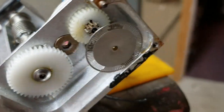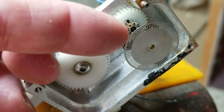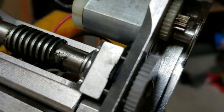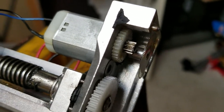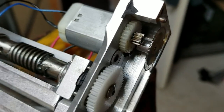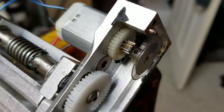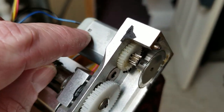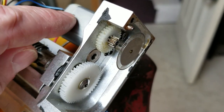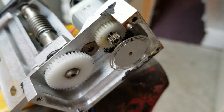I don't think I can get them out — I'd have to dig them out from the other side. My goal was to take the thin encoder disc off and then push them out through the aluminum housing, but it's pretty thin. I put a screwdriver in there and tried to pry it off; there are no grub screws to loosen. I was concerned about applying too much pressure and possibly breaking the disc. Also, that encoder disc is directly connected to the shaft of the DC motor, so if I pulled too hard we might end up in trouble. I'm sure we could source it from somewhere else, but I'm getting a little tired of this project.